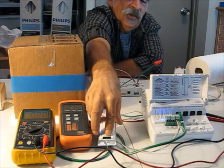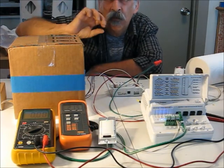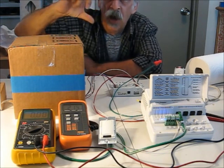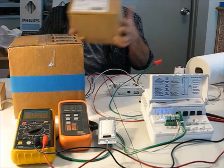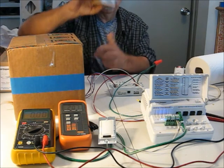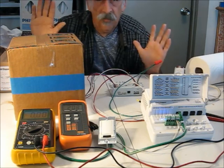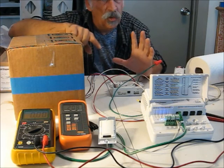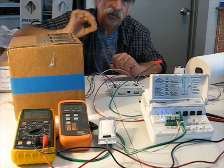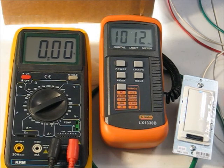And so we will be taking this control and basically trimming it in so that it's more responsive and gives you a fuller control over the dimming from top to bottom. We happen to be controlling an LMRC 213 room controller, and we are using an LMDM-101 switch as the multi-level area control. Doesn't really matter what you're doing. If you have a 0 to 10 volt system or even digital, you need to characterize it and you want to trim it throughout so that you get the best response from the system and it looks like the most professional job.